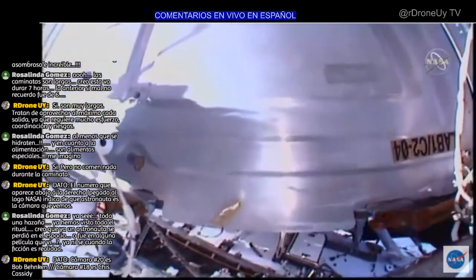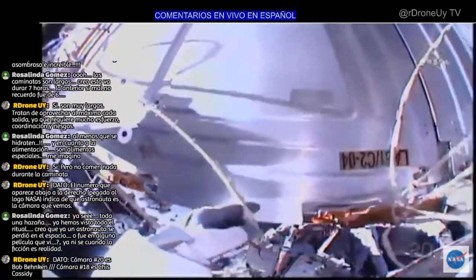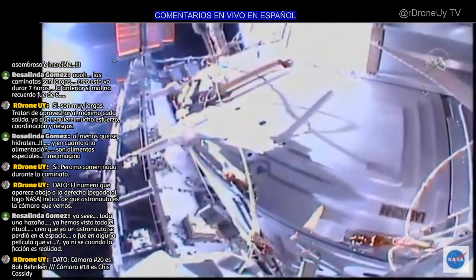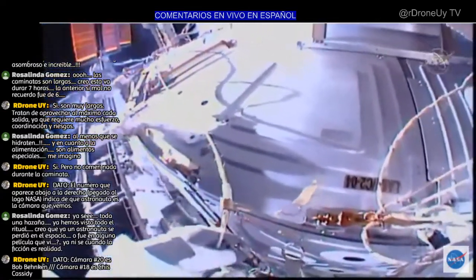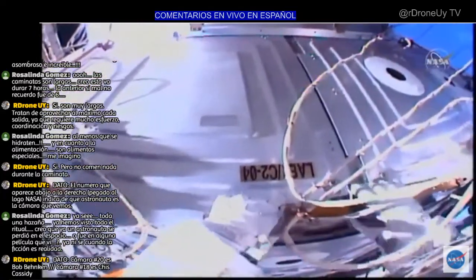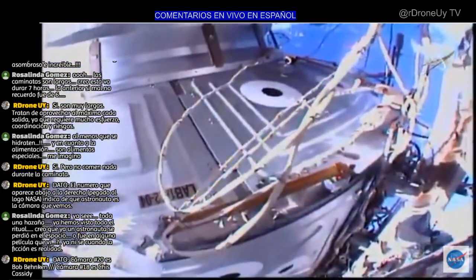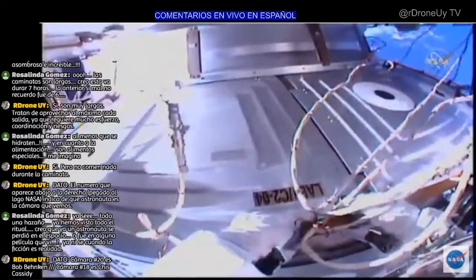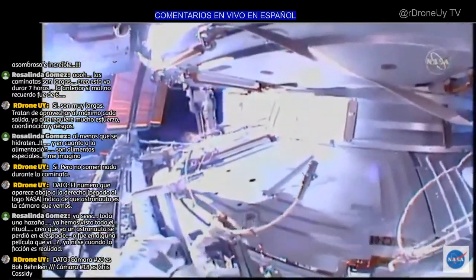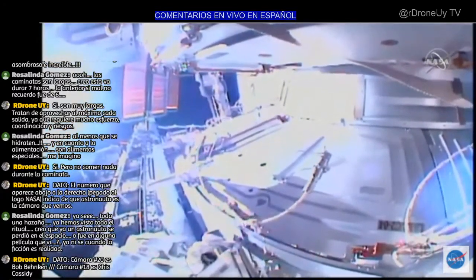Okay, I'm in the rat's nest at the spider cable. Affirmative, Chris. So I believe you're looking for the same bundle as you had last time. It'll be the starboard bundle. We're trying to identify W4300 as the one that we're going to take and mate to your cable. 4300 on the J4 connector.